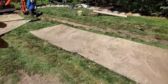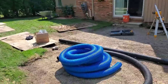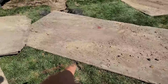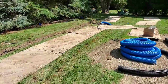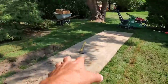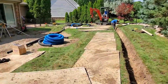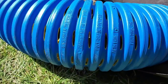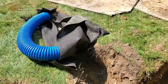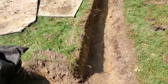Instead of just dumping it right next to our French drain, we ran the Boffman solid corrugated four-inch — it comes in coils just like the high octane — we ran that around the patio. When you're dumping high volumes of water and asking it to come around, it's so much better to use 20 more feet of pipe in a trench that's already dug. Now that the sod is back on these two runs, they moved the plywood over and they're working their way out of the yard. This is the last run — three parallel runs folding back the Boffman eight-slot in the royal blue high octane, out of their way. Then they'll put the fabric in, connect the sprinklers, lay the pipe and stone.